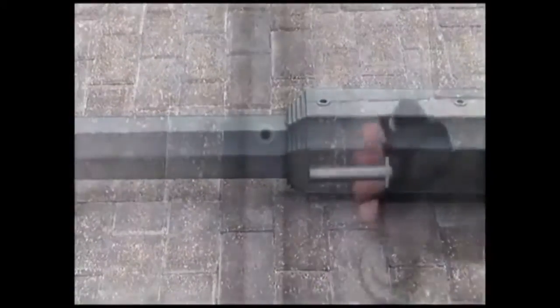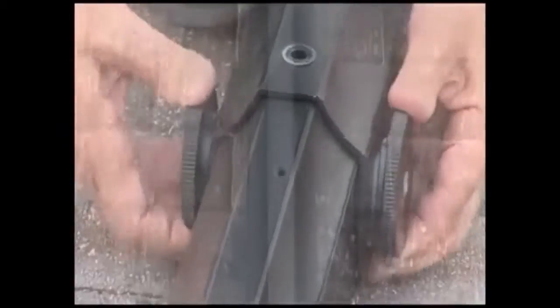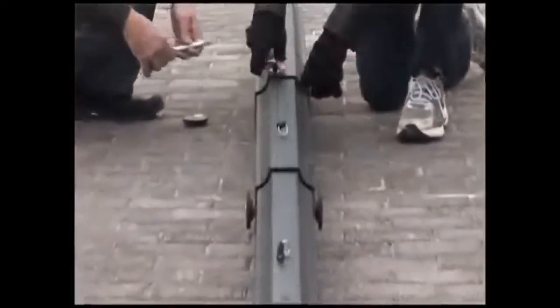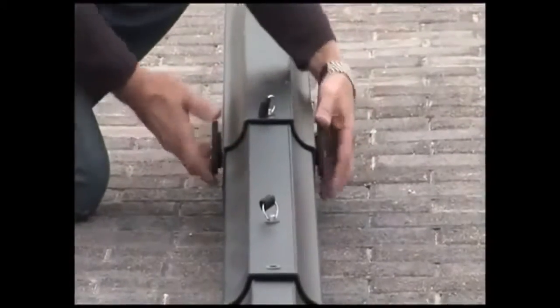It is extremely easy to set up. A union coupling design is allowed by washer and steel bolt and shank, with external clamps. It has also got a pinlock for a double locking system. You simply extend the narrowest section out to start off with and secure it to the second one with the provided bolts. You repeat this process until you have your desired length of crane, which for the purpose of this video is the full length.